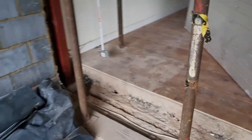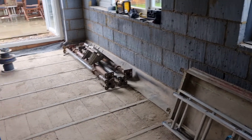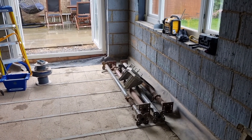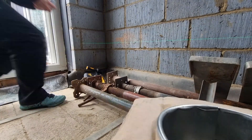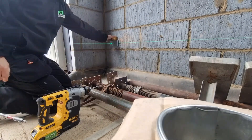When I've finished fixing the back boxes over here I'll move the laser over to the next wall. Floor level is there, and the client wants the sockets at the same height as the existing ones — it's not 450mm but it's not a new build so we can pretty much do what we want. Laser is set up, so we'll crack on with the back boxes.